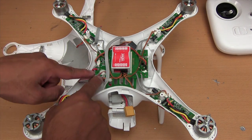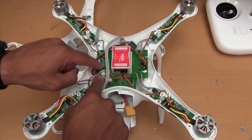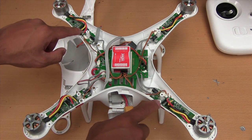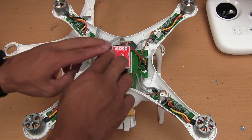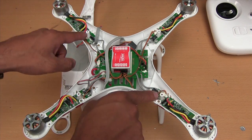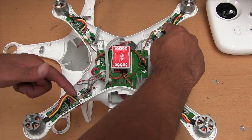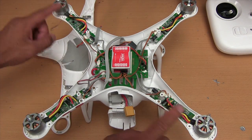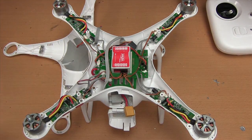It's good to know that whenever you place these wires, if you solder on and off, the right side will go to the right and the left side will go to the left. Also, if you look at these wires, notice that the black is to the ground, but look at the red and yellow. For these two opposing sides, the red is more towards the center, while on these adjacent sides, the yellow is more towards the center. You've got to make sure that you put the motor in correctly when you solder on and off, so that the motor spins in the correct direction.